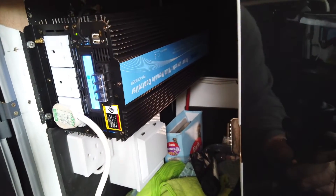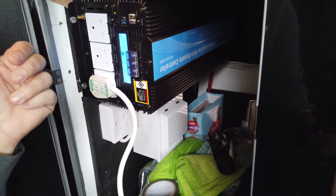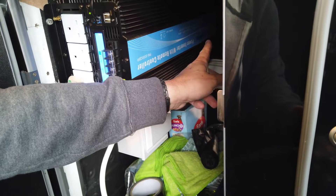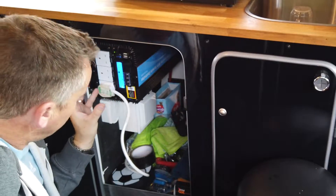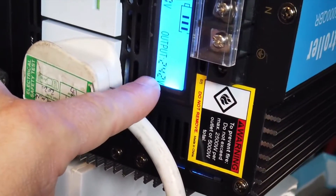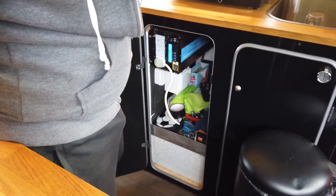Back down to the cupboard — on the front you can actually wire directly into it with a live, neutral, and earth. So rather than running the coffee machine from a plug, you could put it straight through those terminals. At the back you've got the main positive and negative — huge terminals coming up from the battery box. It seems really well made: a sturdy aluminium box, a good frame, nice ventilation. The display shows the output voltage, the input voltage, and the battery bars — all replicated by the remote.